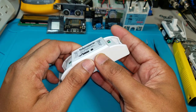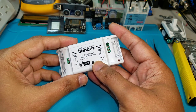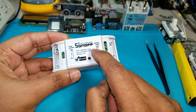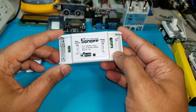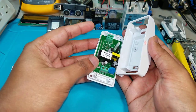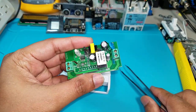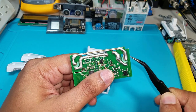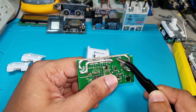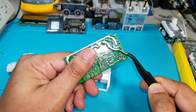In Tutorial 10 I control the ESP8266 with Alexa and Google Home, so I'm going to flash that sketch and control this device with Google Home and Alexa. To open it up there are no screws — you can just run your fingernail or a screwdriver and it comes off. Inside you can see a small circuit board. The two connectors on the bottom carry the mains — one is connected to the relay and one goes directly to the output side. You want to hook your hot wire to this connector and the neutral to the other one.